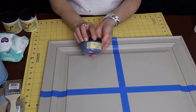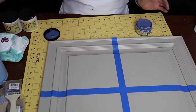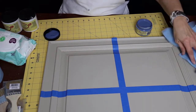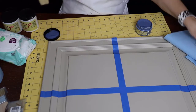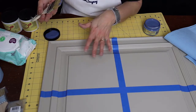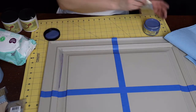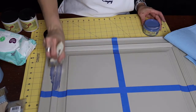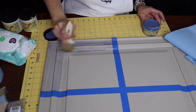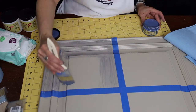I'm going to use the Dixie Belle Black Glaze — it looks blue, but it's black. I'm going to be using chip brushes today and wiping back with lint-free shop towels. I'm going to apply with a chip brush; you can use any brush you want. I'm going to use the glaze on this section just to bring out all the details. If you're doing kitchen cabinets or if you have a piece that has a lot of moldings, you can bring out the details by applying the glaze in the details. So I'm going to apply the black glaze all over this area and do this whole top here just to give it an extra effect.